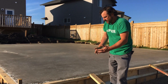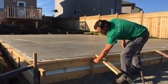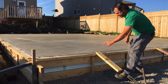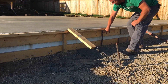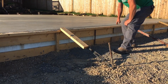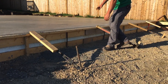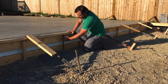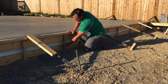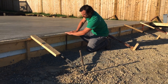So for do's and don'ts — first off when we stake this all out, I put my pins. This is a wood stake but most of the time I use these steel curve pins that are 30 inches long. I did those every three feet, and that worked extremely well. Because I had that thickened edge, I have two 2x6's and then what I would call an L tie at the top.